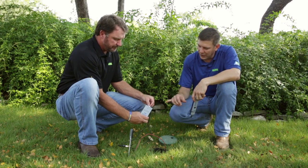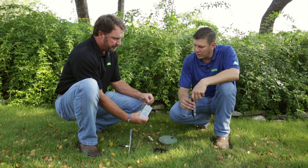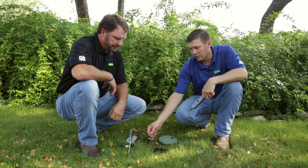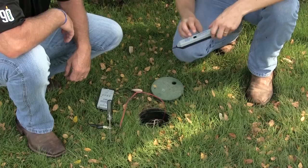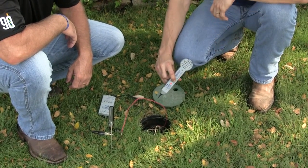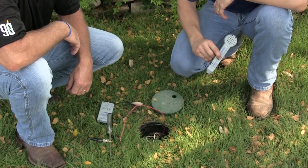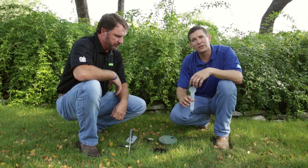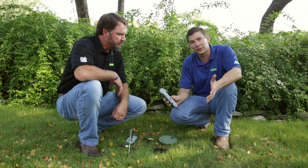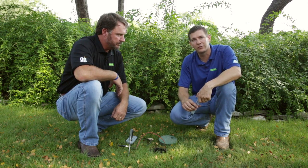Okay, so he's got it hooked up. Now he's just going to take the toggle switch and set it to tone, and that's all there is to it. Now this amplifier will pick up the tone going down this wire. The closer you get to it, the brighter the light gets and the louder the tone. So when we get to the clock where there's 10 or 12 wires, we're going to touch every wire, and the wire that has the loudest tone and the brightest light is the wire that goes to this valve.